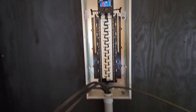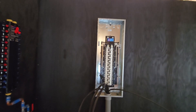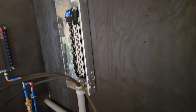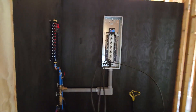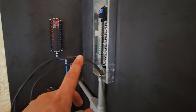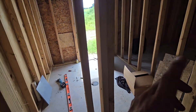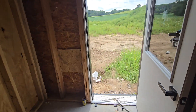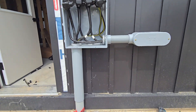There's a lot to this stuff — if you're not sure what you're doing, leave a comment or email me and I'd love to help. Everything here follows National Electrical Code, but your local code may have additional requirements, so always check. Next I'm going to finish tying in these mains, then go up to the panel at the road and do the same thing in the junction box outside to connect to that panel — because up there I also can't connect 350 MCM wire directly into the panel, so I have more Polaris connectors up there.